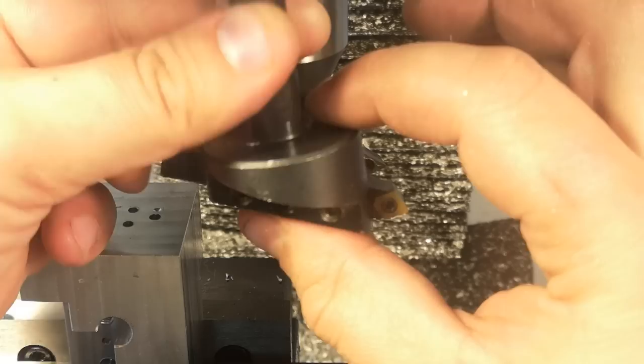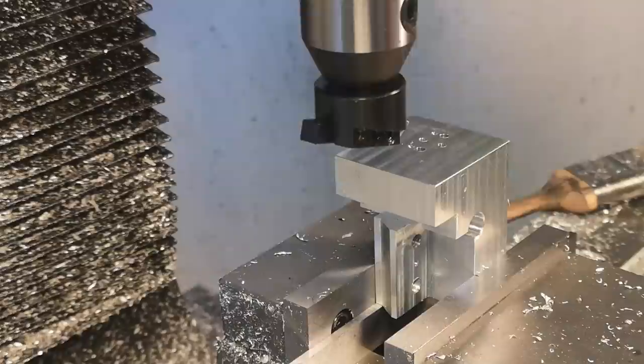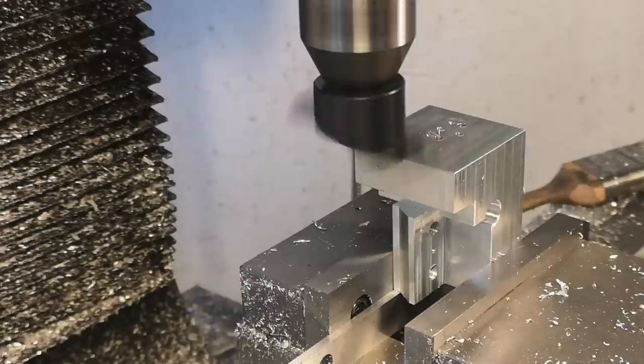The consolation prize I almost won was using my bigger fly cutter — but the back of the tool sticks out a little too far. If you think about it, you'd get about this deep and then start hitting with the back. So I've actually set the radius to be a little bit small, because what I want to do is put the pieces together and then do them both at the end, thus simulating that I did a good job the first time.